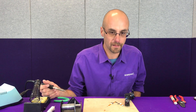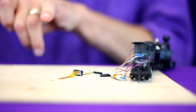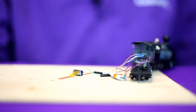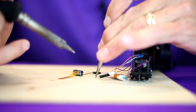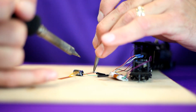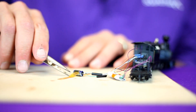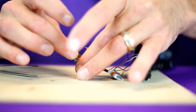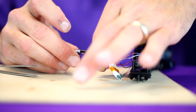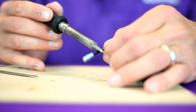One of the last steps before we button up the tender is to add the capacitor included with the TSU 1100. You'll see a stripe on one side of the capacitor — it will be a lighter color than the rest of the body. That stripe goes to the ground wire of the TSU 1100, which is the green and yellow wire. Slip heat shrink over both posts of the capacitor covering the connections, and we're good.